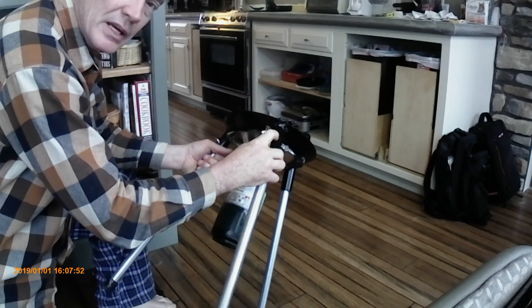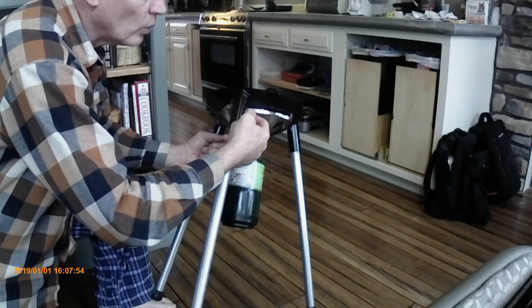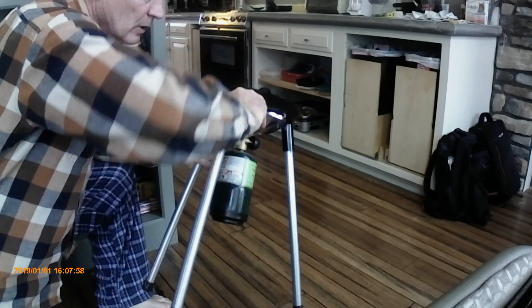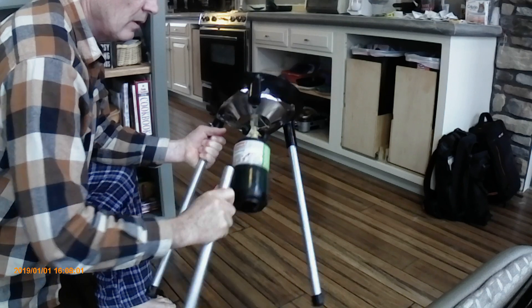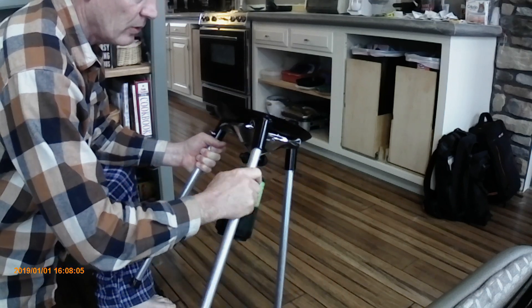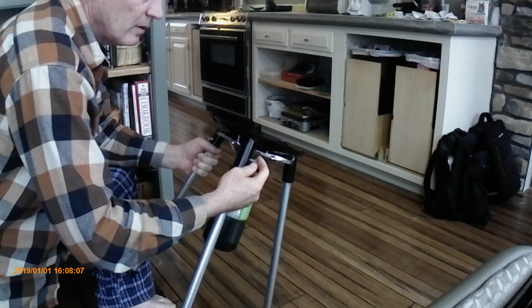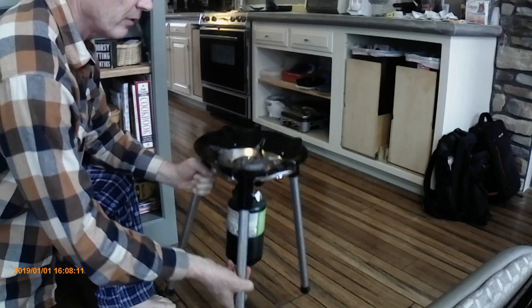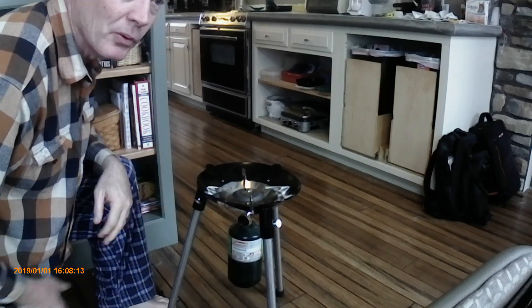These are DOM tubes with a hole drilled and tapped in them to allow a piece of just regular old three-quarter inch galvanized conduit for the legs. Put it in, tighten it up, and then rubber chair caps on the bottom. So really a simple setup.